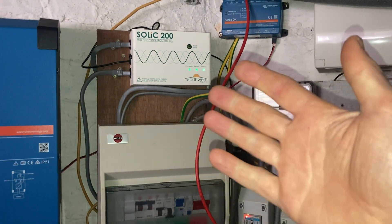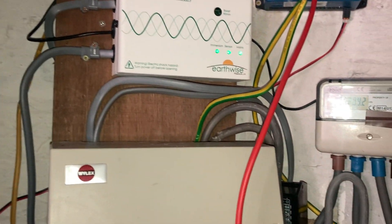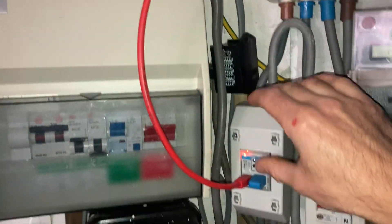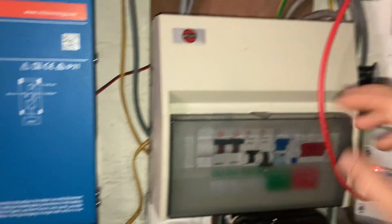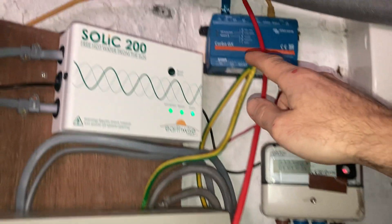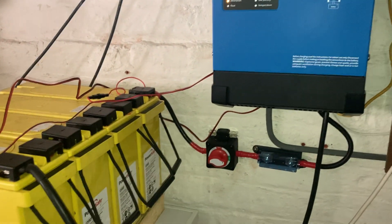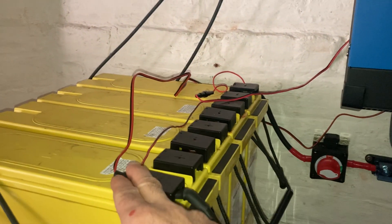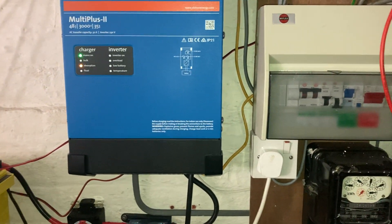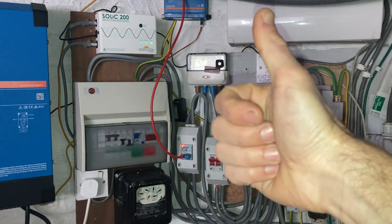Questions or comments? Leave them below about this Solic and about the installation. I have plans to put up videos about this but when I was installing it I was somewhat taken away from video making. What confused me is that there's a current clamp measuring solar and an energy meter measuring power in and out of the house, with its own way of measuring battery stuff. Victron want 30 quid — or the websites selling Victron stuff want 30 pounds plus — for a piece of data cable and a USB converter, whereas the USB converter costs a fiver on eBay. You've just got to figure out the wiring. What caught me out was the addition of a temperature sensor on the negative — I didn't do that and it didn't really want to charge or discharge. Solic, I think you're working again, which is super. Questions or comments, leave them below. Like and subscribe if you haven't already. Thanks for watching, see you later.